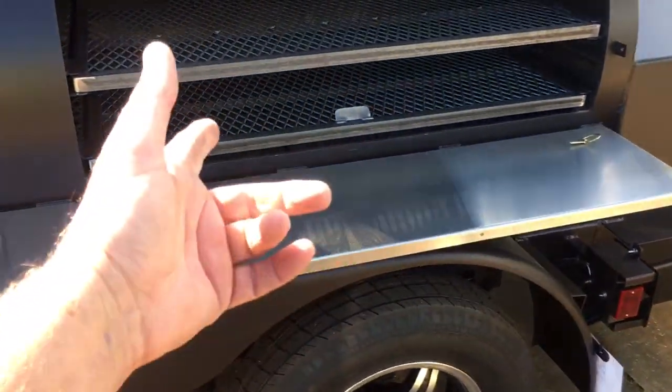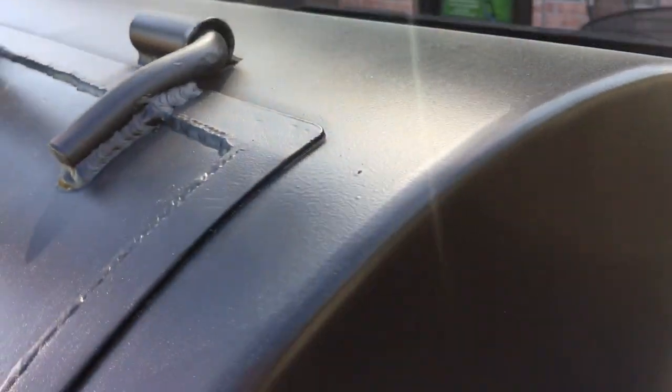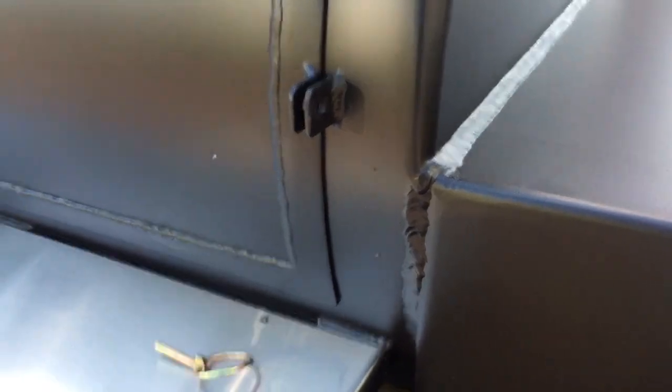You've got our typical tuning plates on these big cookers. Look at the wall thickness — that's 3/8-inch thick steel, extremely thick. We've got our flanging, nice cut corners, and end caps that are nicely buffed out. You've got tight doors — no gaps, no leaks, all the way down. The firebox is nice and smooth with flanging all the way around.